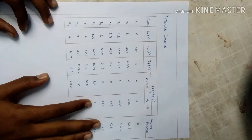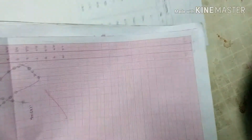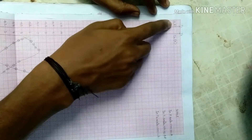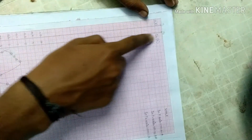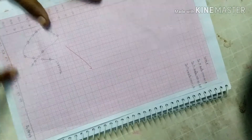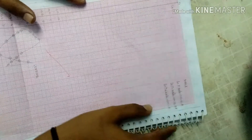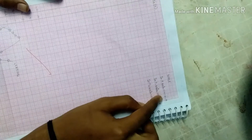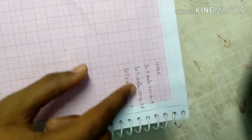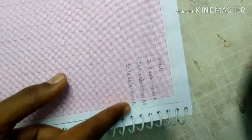With the help of these values we are going to draw the V and inverted-V curve on graph paper. Take Y1 and Y2 axes. On the Y1 axis we are drawing power factor; on the Y2 axis we are marking the armature current (Ia) values. On the X axis, the field current (If) values are written. The scale: X axis — 1 cm equals 0.1 ampere; Y1 axis — 1 cm equals 0.1 power factor; Y2 axis — 1 cm equals 1 ampere.